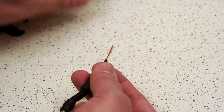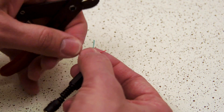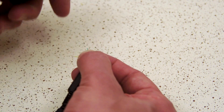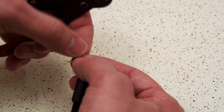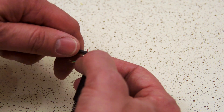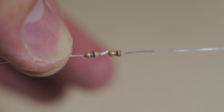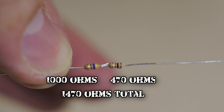This reveals three separate insulated wires: a red wire, green wire, and a yellow wire. Go ahead and strip the tips of these. I recommend you tin the tips of these wires right now — tinning means placing some solder at the tips of the wires so they're sealed up and ready to be soldered to something else. Remember that 1500-ohm resistor I needed — well, I didn't have one, so I soldered a 1000-ohm resistor and a 470-ohm resistor together. This effectively gave me a 1470-ohm resistor, which is close enough to the 1500 that I needed.